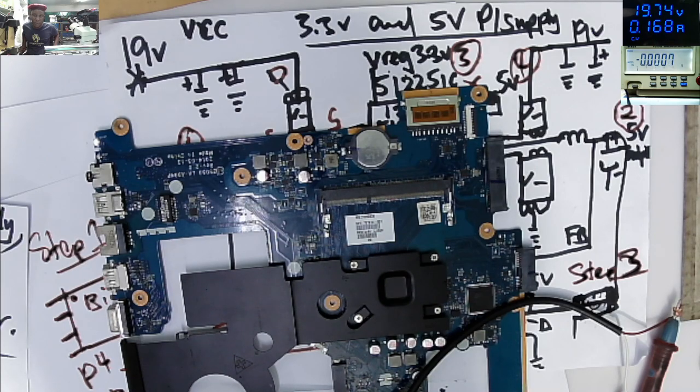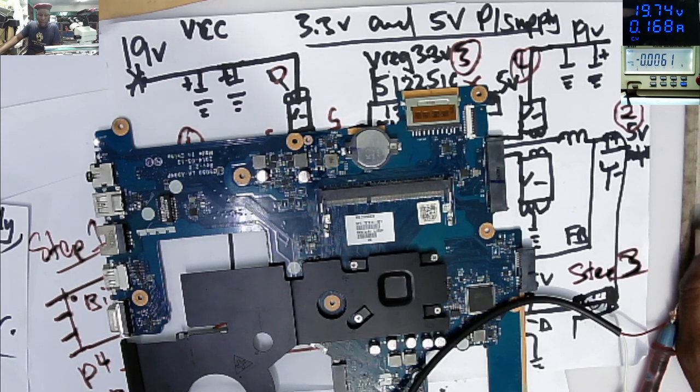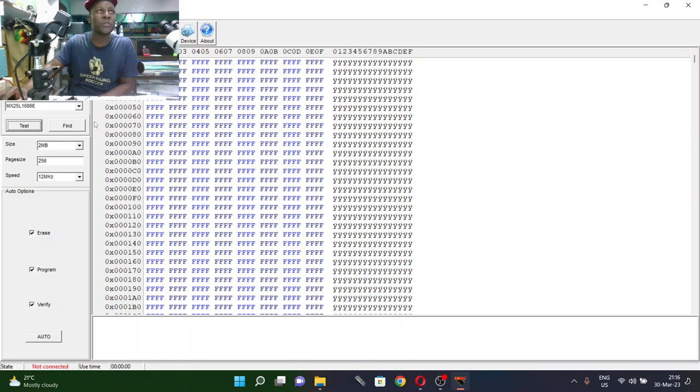And what I'm using, I bought a programmer. Let me see if I can show you. I bought this programmer. Where is that software? It's EZP 2009. This one, it's easy to use. You connect to read the chip, erase, write, verify. That's what I'm using on most of the laptops with corrupt BIOS chips. I'm flashing the BIOS and reloading the software.